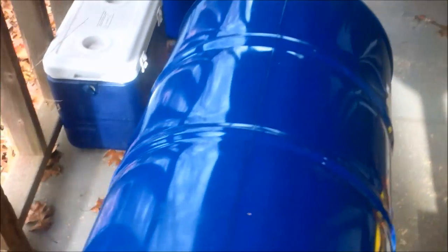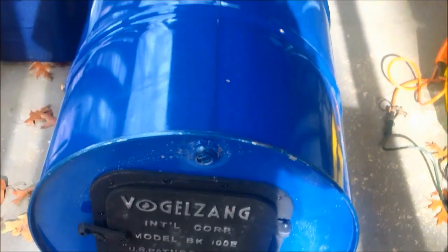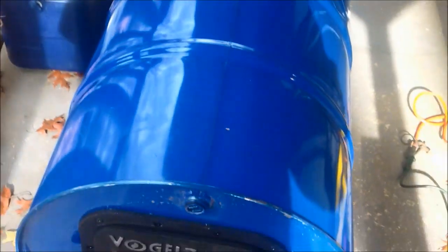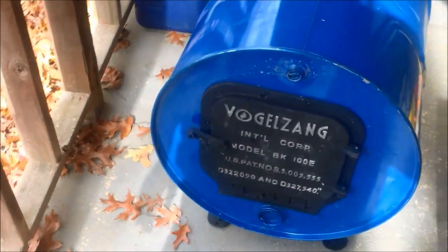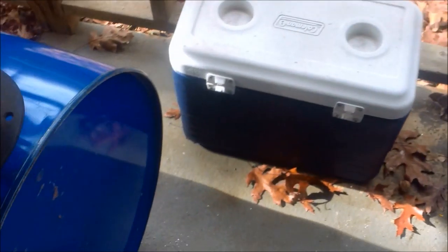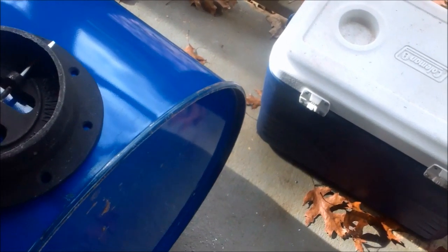And also we'll be putting a grate in there to protect the bottom of the buck stove, so we'll get maybe 10 to 15 more years out of it than you would if you just set coals on the bottom. Alright, now we're just going to sit that cast iron flue piece back here, and it is designed to kind of sit back here a little bit.